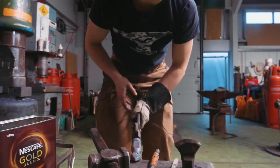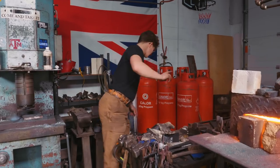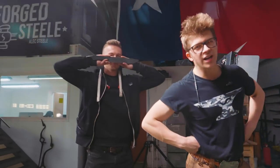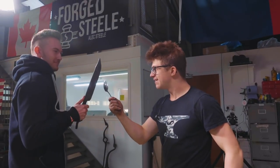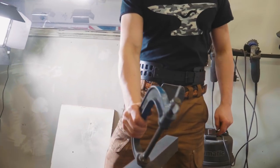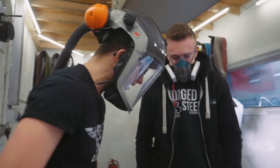And of course I put my touch mark on it. Give it a little wire brush, and this should be ready to cool down. While that is cooling down, I am going to teach Jamie how to grind his knife. The first thing that we're going to do is angle iron in the vise, big G clamp, big grinder. First things first — establish your flat with the grinder.